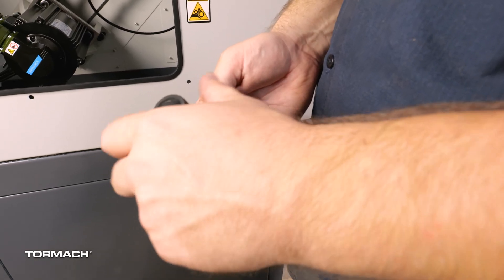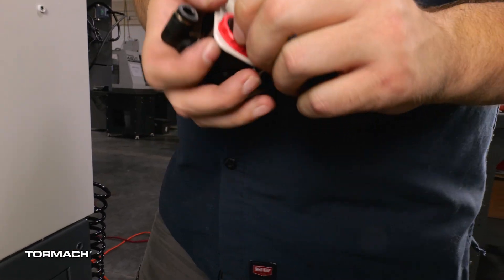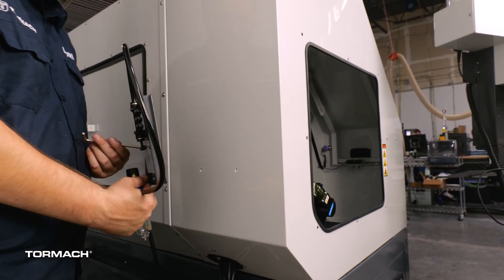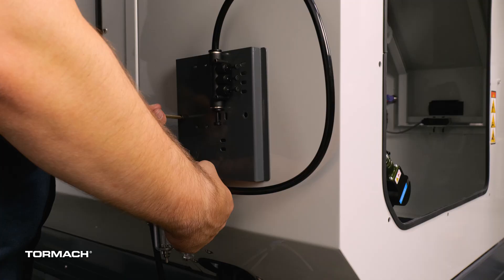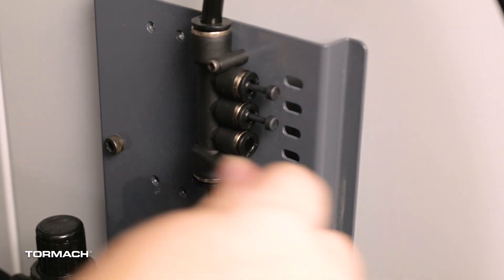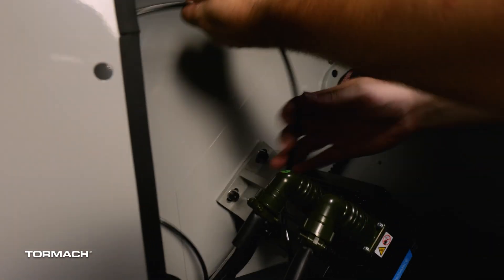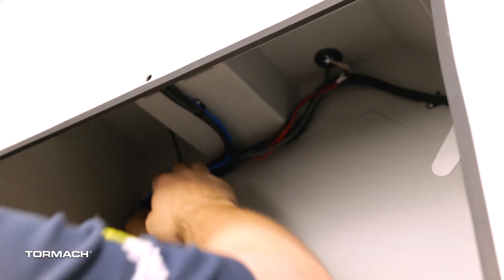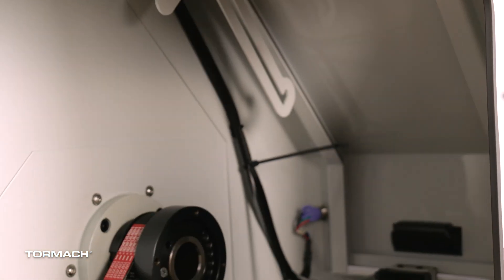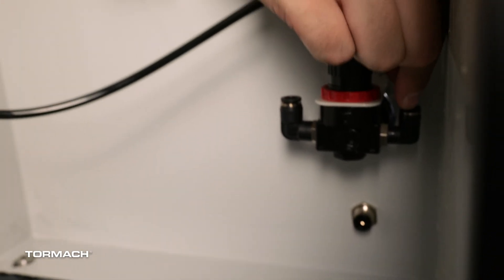Remove the red threaded ring off of the pressure regulator and slide the bracket onto it. The bracket should allow for the regulator face to be sticking out the front hole. Hold it in place and secure it with two screws. Install the pressure regulator panel onto the right rear of the enclosure with the provided screws. Remove one of the regulator pins from the push-to-connect fitting and install the long thin air line into this. Take the other end and feed it into the rear access panel. On the inside, secure this air line to the cables that go up and over using zip ties — it needs to reach the air regulator you just installed. Clean up the zip tie ends after securing them. The thin air line should go into the right push-to-connect fitting.